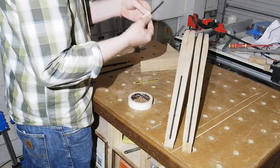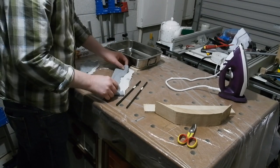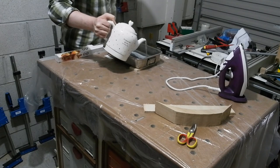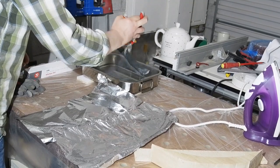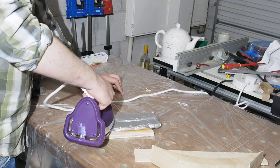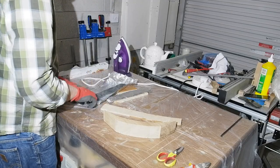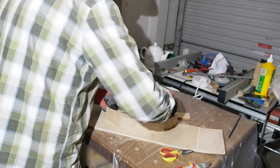To get the inlays to take the curve, I need to steam bend some of them. The pieces that cross over the join in the front leg only need to bend one end, so I mark from where with tape. I don't really have need for a full steam bender, so for these little pieces I'll use the hot bath then iron technique. I wrap the pieces in cloth from an old jumper and place them in a tray covered with boiling water for about 10 minutes. Blackwood releases a lot of oils under heat — it'll start to discolour the water slightly and has an interesting smell, a bit like berries and tobacco. They're then wrapped in foil for a good steaming, iron turned up to 11, applying heat for about another 10 minutes. When the escaping steam smells strongly of berries and tobacco, you know you're getting there.